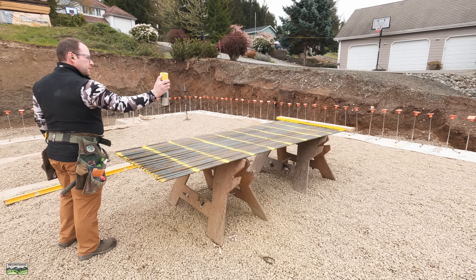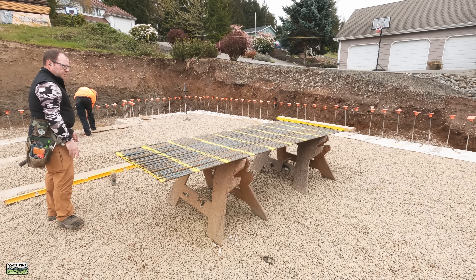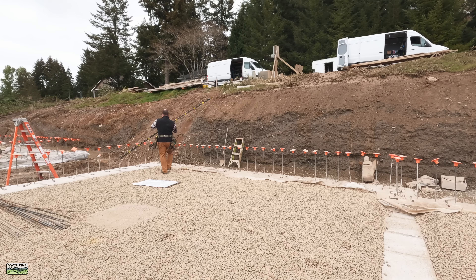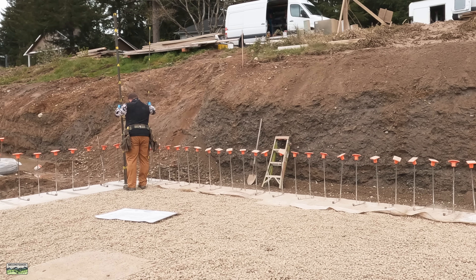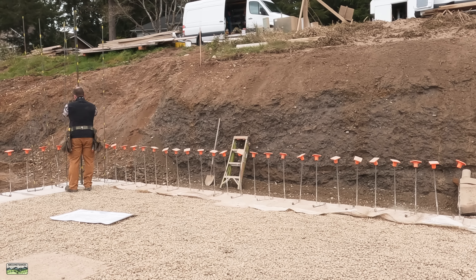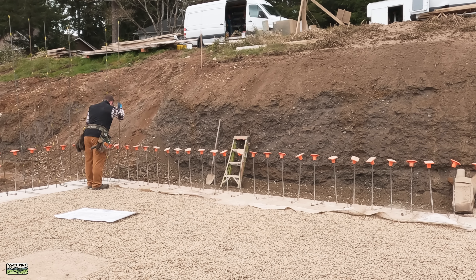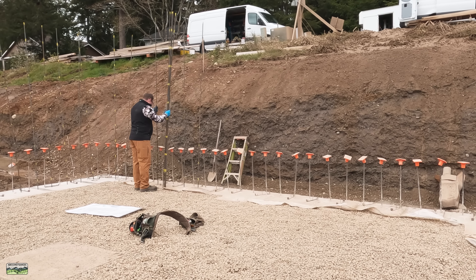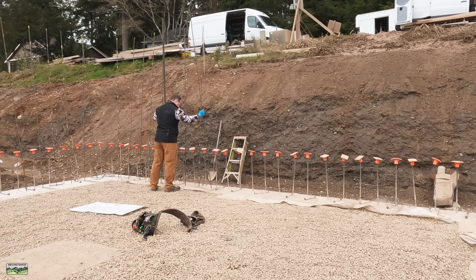I find that if I just spray paint 12 inches on center then I know where to place everything. Point the can up and empty out the nozzle — it's good to go. I painted the top so that I know that it's the top. As Tyler drills the holes for the 10-foot sticks, I can go ahead and take those pieces I had just laid out on the sawhorses and drop them in the hole. Those holes need to be basically six inches plus or minus maybe a half inch.